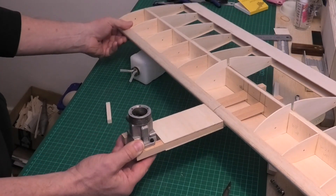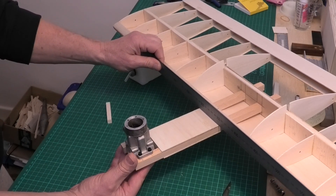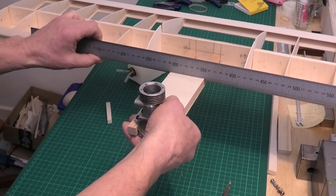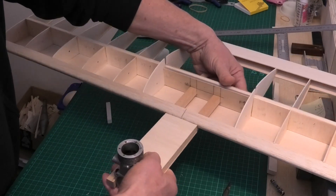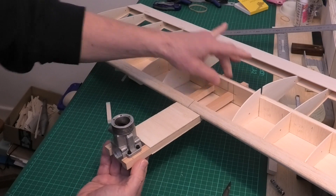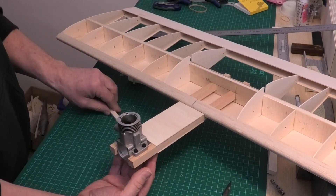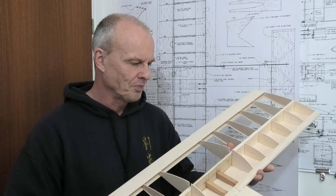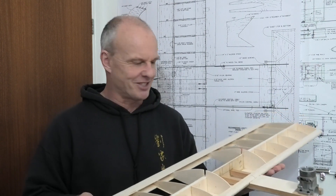When preparing the holes, I used a ruler to make sure the mount was nice and parallel with the front of the wing - nice and square in the right place. I'm going to epoxy all of this into place and then we've got our shear webbing and engine mount all nicely finished. With the shear webbing, the whole wing feels really quite substantial. I hope you enjoyed that - please subscribe and come back to see how we get on with the rest of the build. It's really starting to take shape now.